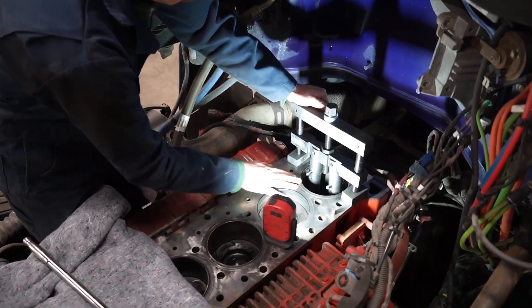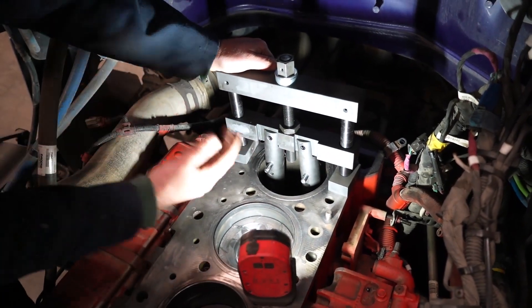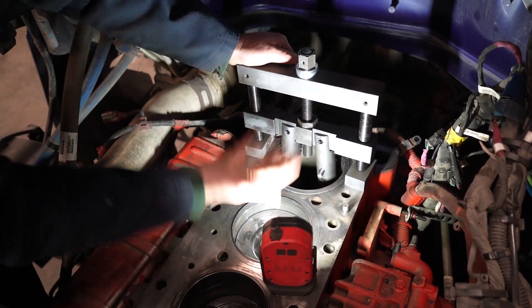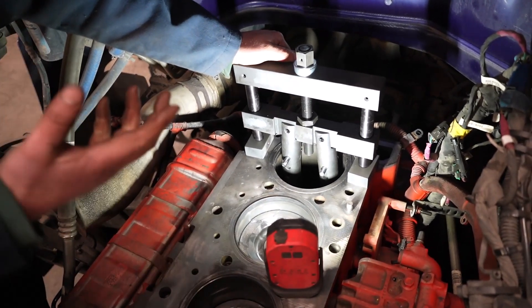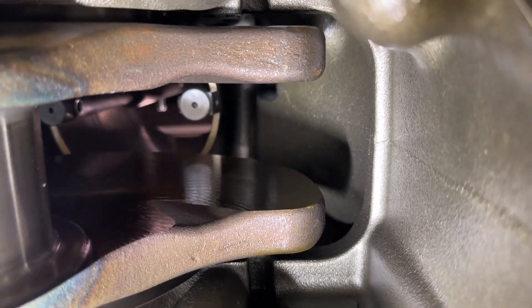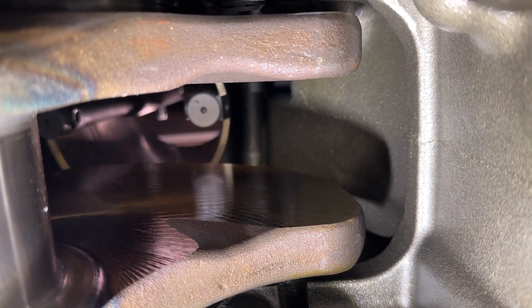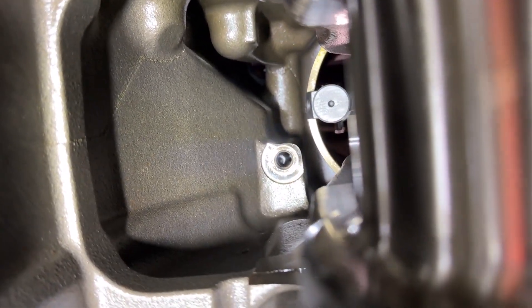We got the tool inserted down in the cylinder. On this particular engine, we've got the legs set at the highest setting. We want to make sure the blocks are not touching the liner, because obviously you don't want to be pulling and fighting against yourself. So we've got those straddled against the liner. We'll go underneath and show you what it looks like — how it's properly positioned on the liner underneath the block. After we make sure everything's okay down there, we'll get started up top pulling it out. When you stick the tool down in here, make sure it's seated. The legs are seated on the liner. There are two different sets of teeth, so you want to make sure you have the right set. As you can see, that's set in pretty well.